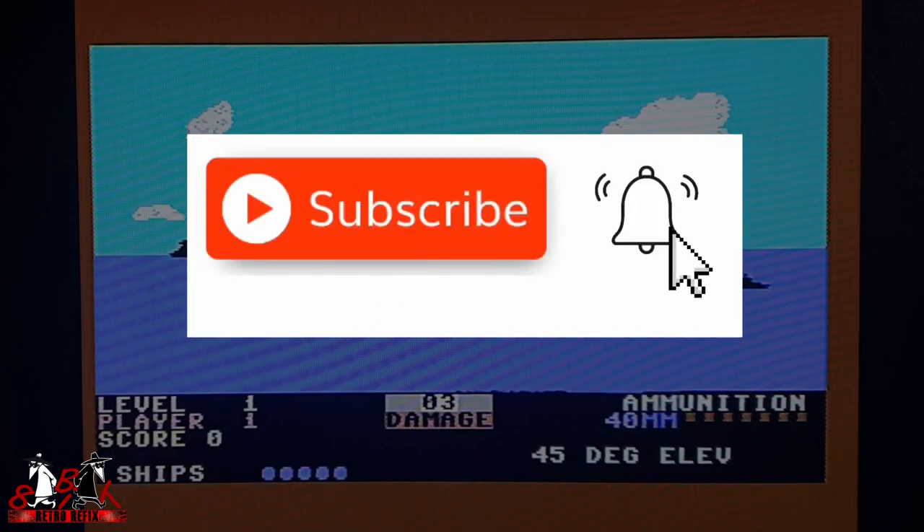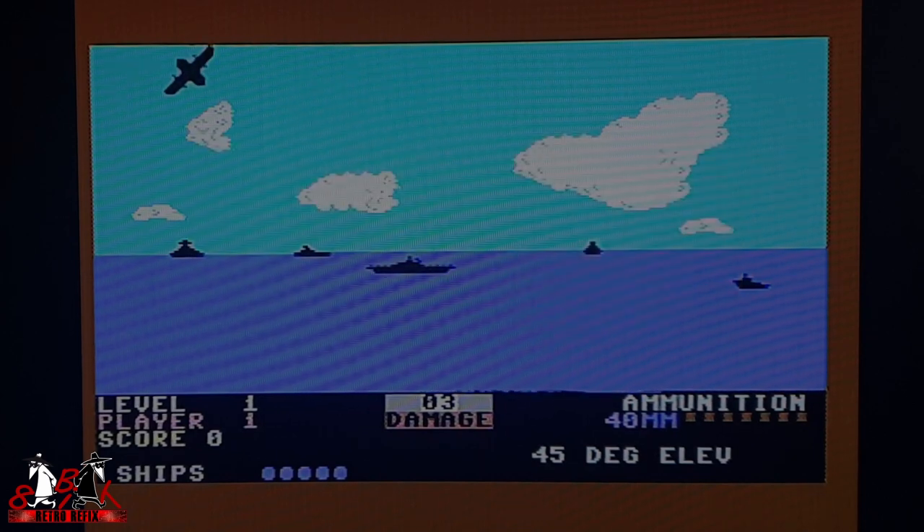If you've enjoyed this video please hit subscribe, hit the thumbs up, and hit the notification bell. Drop me a comment down below if you've enjoyed it or if you've got any problems. So there you go — we've converted the 8501 to 6510 Commodore 64 CPU to save us a fortune. If you go to hackjunk.com all the instructions are there — it's really easy. Pop onto eBay and search for 8501 CPU — they come straight up for only about 20 pounds. You can buy that conversion board, pop a 6510 into it, and solder the jumper across for the tape deck. I've got the 1551 disk drive so I don't use tapes very much, but it's still nice to have that option.